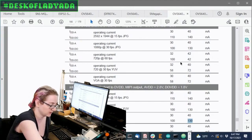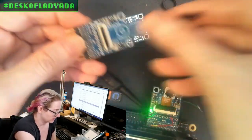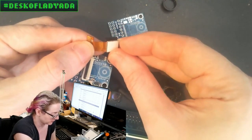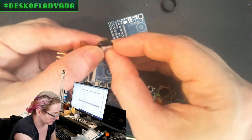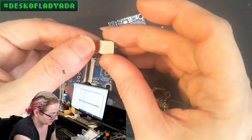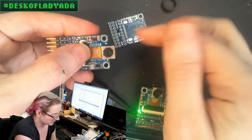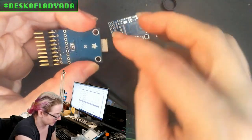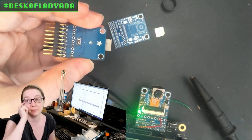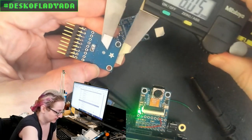Maybe you can go to the overhead real fast and I can show. So you've got the camera breakout, and then the camera — there's a metal body and then there's this very thin tape, I don't know if it's thermal. You remove this, place it in here, and then this PCB is going to extend a little bit farther. On the back of the PCB I'm going to have a lot of vias through the ground plane and then a little heat sink on the back.